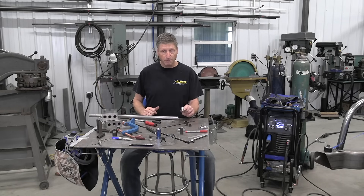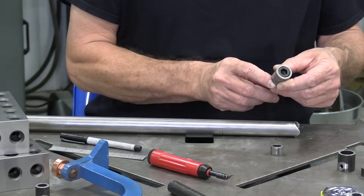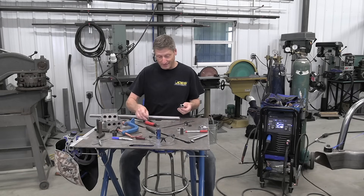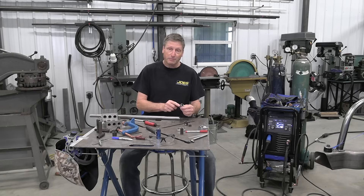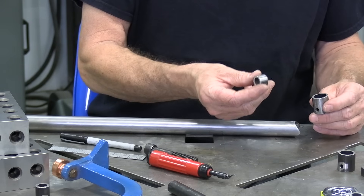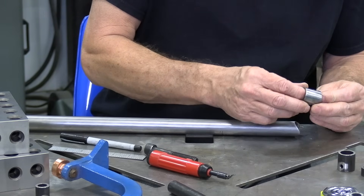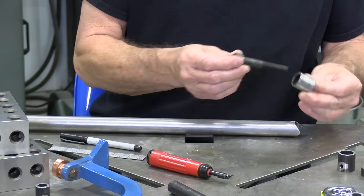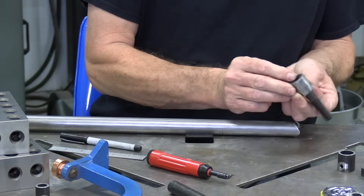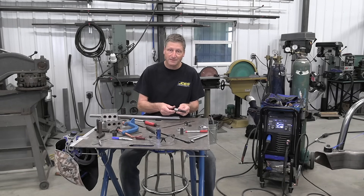I used to machine the bolt bosses that get welded to the end of the tube — I like to make them so that the socket head bolt actually fits flush inside that mount. But I found an easier and quicker way. I took a piece of one inch eighth inch wall DOM tubing and drilled a couple holes in the side of it. Then I took a three quarter inch piece of eighth inch wall tubing and cut it to a half an inch — that fits perfectly inside the one inch DOM. I can put my socket head bolt in there and it fits nice and flush. Now let's plug weld these holes to keep that center insert in place.